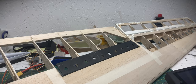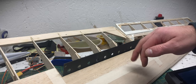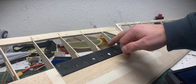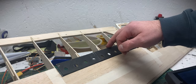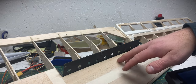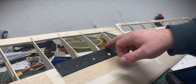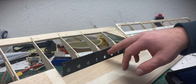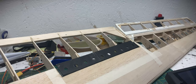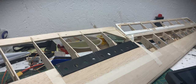That's got it. Once I set the travel end points — that's full throw there which I'm very happy with, probably more than enough. I'll set the end points and adjust for a slow opening and that will be a nice job done. There's a very slight non-return issue — it stops just before fully closing, there's a bit of slop in the mechanism because of the geometry, but only a very small amount of pressure closes it. Wind resistance and airflow will push it down, I'm sure of it.